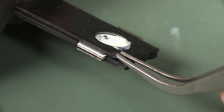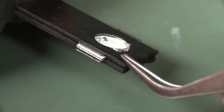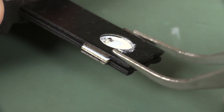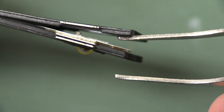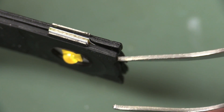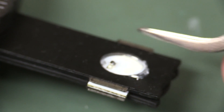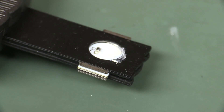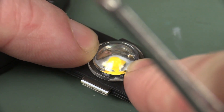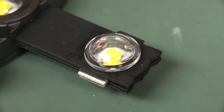The first thing I notice is they've got two separate parts - a top part and a bottom part - with all this rubber around it. That's how they're getting the waterproofness: the pressure of the rubber going down against the board stops water ingress onto the main PCB. It looks like they've got two strips of spring steel on the top and bottom, with the PCB wedged in between. I rather like that solution - it's really quite an elegant one to get the waterproofness along the whole length of the thing. They were really thinking when they did that.